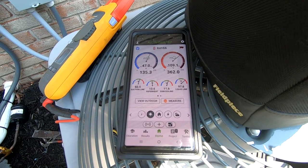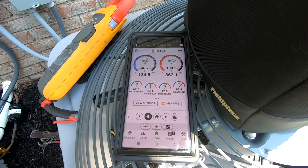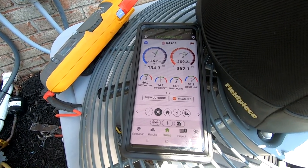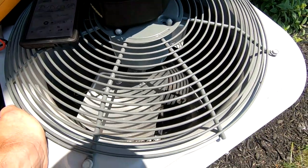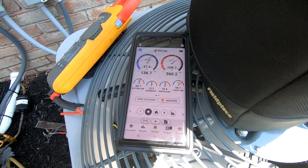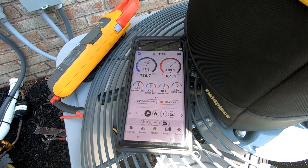There it is — 11. It's heating a little bit there. Superheat, if you noticed, was 12 to 13 before, and now we're at 14. I still need to double-check the downstairs unit just to be certain. That way you don't come back later for the same thing — that would be bad.